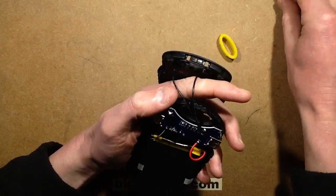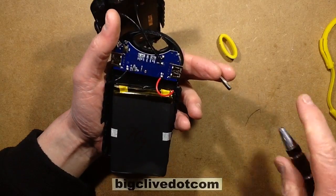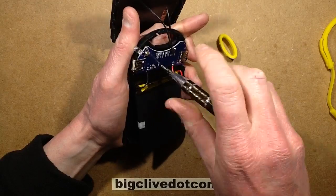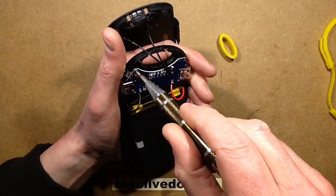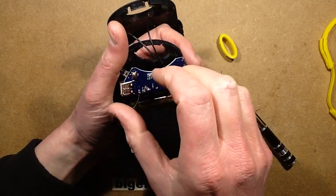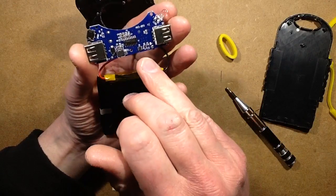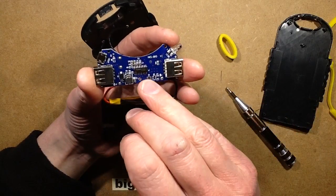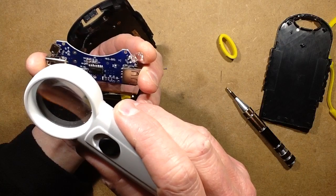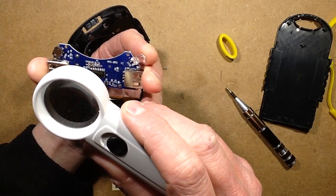So the solar panel - let's put that circuit board out. I might need a smaller screwdriver bit for that. It has three screw positions but just two screws. Changing the LED should be fairly straightforward - it is through hole but it's soldered on the other side. Popping that off reveals the MOSFET package. It's got a position for two parallel MOSFET packages, which gives extra current protection, but in this case they've just got one, which is cheapening out. The chip has a number on it - that's good - T-Power TP4351B.